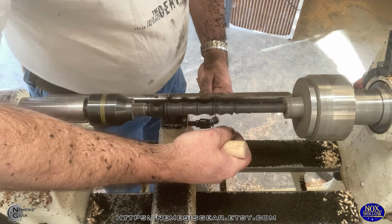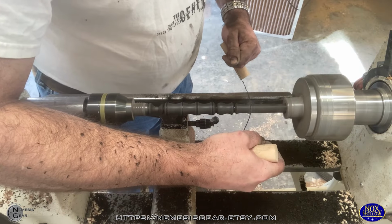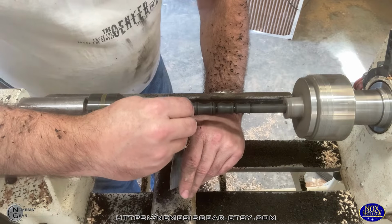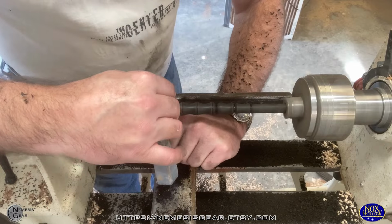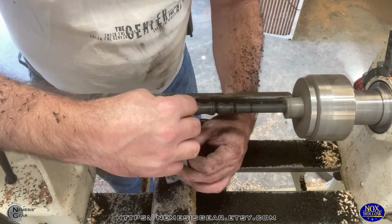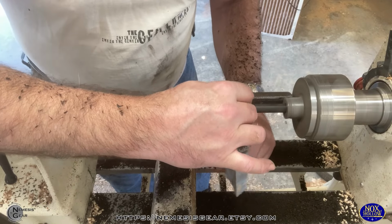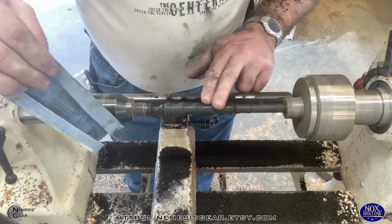But the other part is the ebony is already so dark that coloring options become difficult. Usually, all the other woods that you work with are going to be lighter than this. So changing the color with ebonizing fluids or dyes or things like that is totally doable. But we're already basically working with as black as you can get, so making it darker is just not an option. Especially since ebony is such a rare, precious wood, I didn't want to do something completely simple on this.